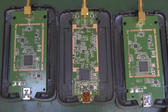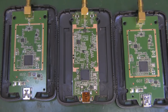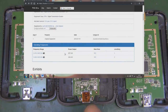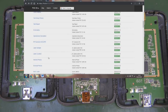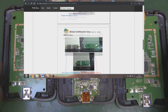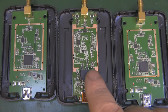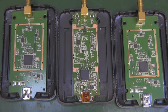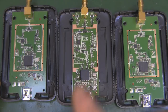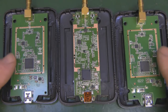Here's a look on the inside at the boards themselves. I've got the genuine one in the middle and the fake ones on the outside - you can just visually see the difference. As I stated in the first video, get the FCC number off the back of the Alpha, type it in on the FCC website and you'll bring up a whole host of information that Alpha, by law, needs to provide for FCC testing - internal photographs, specs and everything else. Just match the internal photographs up. This is the genuine one and it matches the photographs on that website, completely different from these two. You've got probably twice as many components on the genuine one than on these two cheaper ones.